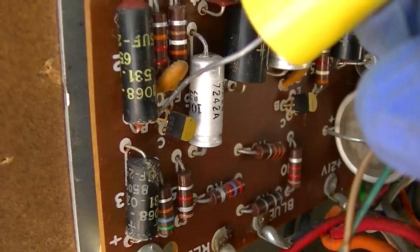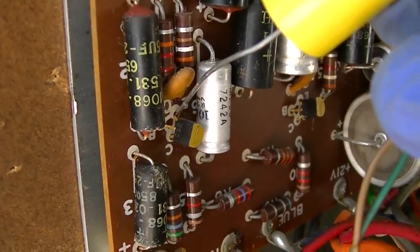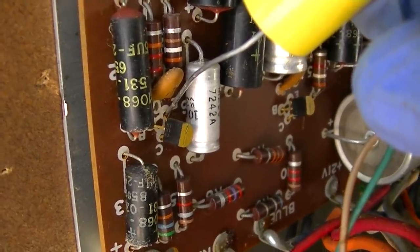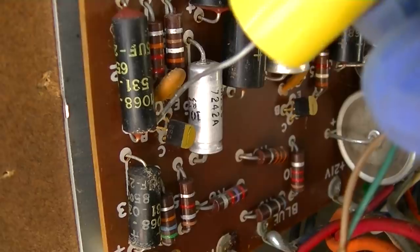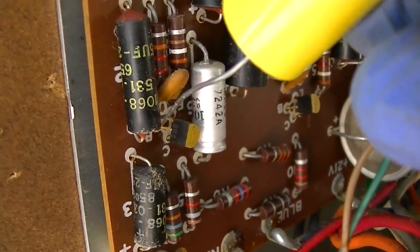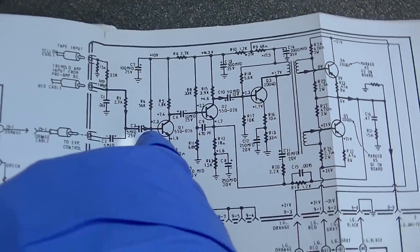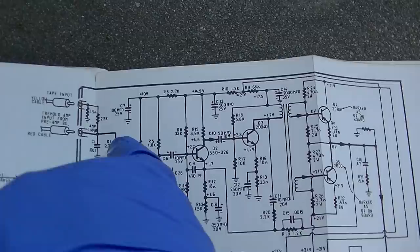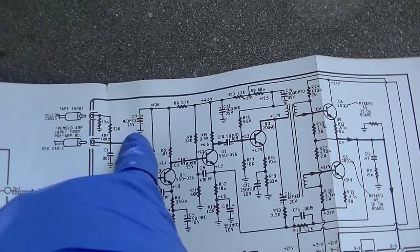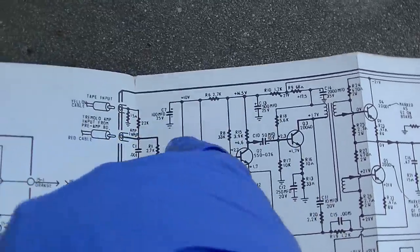Okay, we have sound on the base of the first transistor in the amplifier. Nothing on the emitter. The airplane does not count. And nothing on the collector. We do have it on the base. Okay, so we got a signal here on the base. We have nothing on the collector or the emitter. What do we have, another shorted capacitor here? What do you want to bet one of these is shorted? Either that 500 or that 100. Gonna have to take this amp out.